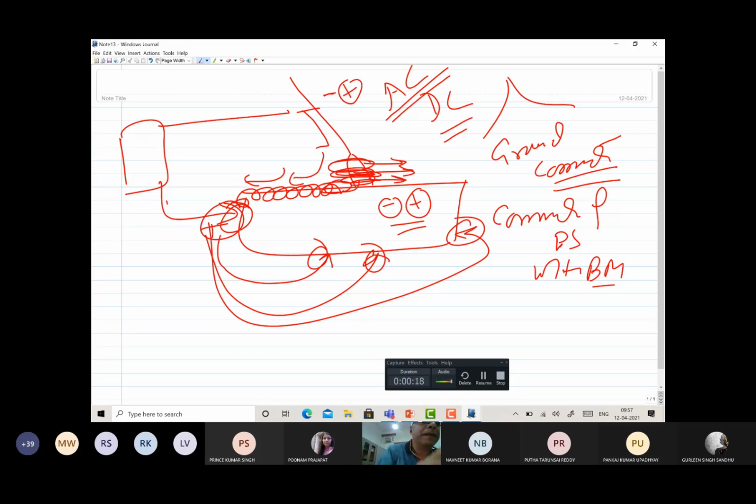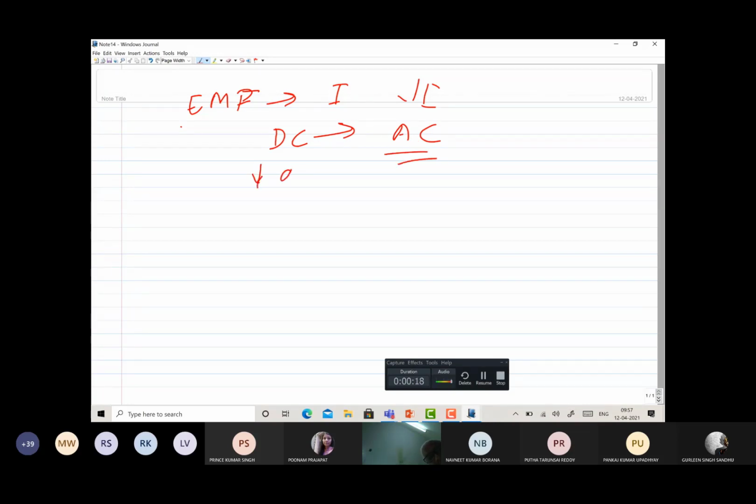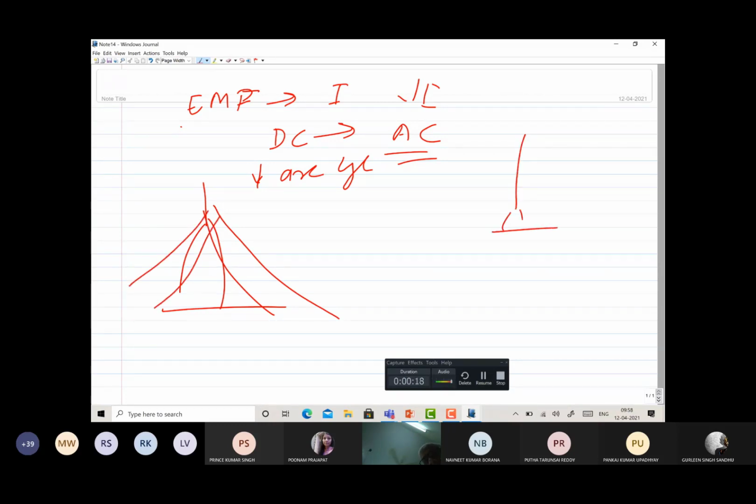Okay. So what are the methods to negate or neutralize the effect of arc blow? Since arc blow depends upon the electromagnetic force, which directly depends on the magnitude of the current, if possible, try to reduce the current. That's one. If possible, switch over from DC to AC. That's another. Third is to reduce the arc length. If the gap between the electrode and the base metal is more, there will be a greater tendency for deflection of the arc to a greater extent. And if the arc gap is less, the extent of deflection will be reduced. So reduce the arc length.